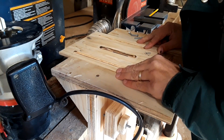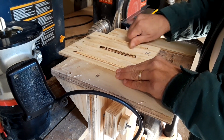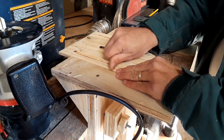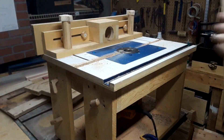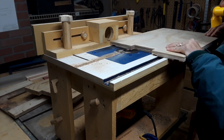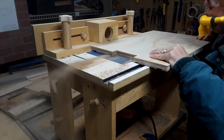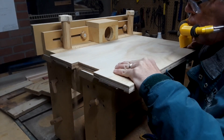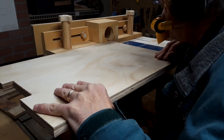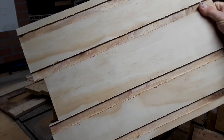If you have a CNC, this is going to be a snap, because a lot of fussiness is going to be required to make sure the top is exactly perpendicular to the base and to make accurate templates that also slide into the top with no side play. Starting as per the plans with a piece of 3/4-inch plywood cut 20 inches by 14 inches, a 4-inch by 1-inch slot is cut out of the middle of the top. This allows space for the router bit when in use. One of my changes is to add slots for the carriage bolts — these slots give clearance for the head of the bolts, and another slot will be cut all the way through for the shaft.